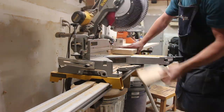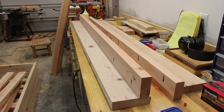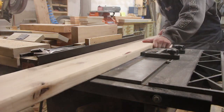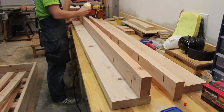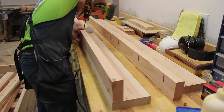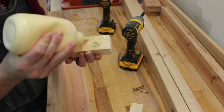For the structural posts of the bed, I liked the idea of J-Bakes, where a 2x6 and 2x4 form the corner posts which then support the bed frame. I cut off the rounded corners on the 2x2s and glued them together with the assistance of a few pocket screws. I also built in some redundancy to make sure the top bunk won't fall through the bottom bunk by adding some glued blocks under the corners of the bed.